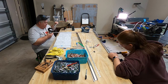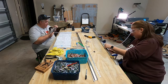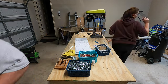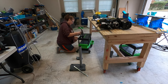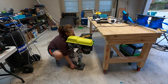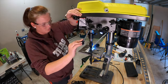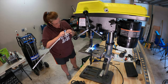Moving on, there's a lot more dimpling that takes place until you get to Step 6 on 9-9, where you are machine countersinking the holes on the trailing edges. We had just got a drill press at this point and when I went to start using it, I found that the table wasn't level so I had to get that squared away. We were also using a countersinking jig from Cleveland Tool that has a notch cut into it the right shape for those trailing edge wedges to sit in, making it a nice flat surface for fast, clean, easy countersinking.